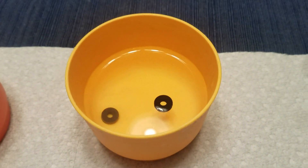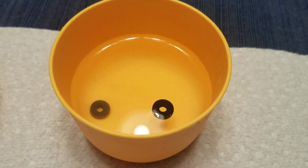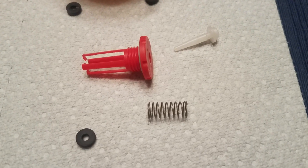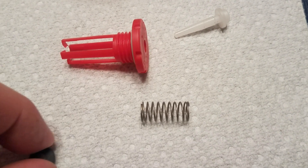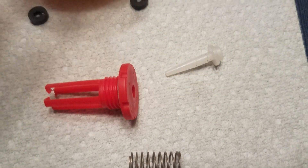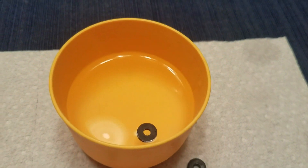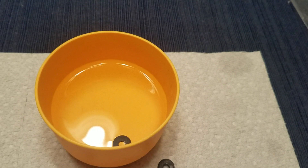So it's just a quick and easy way to test whether you have VITON or butyl rubber o-rings for your drinker. After disassembling a new assembly and dropping the washer into the solution, it floats — meaning the new assemblies are being shipped with butyl rubber and not the more stable VITON product.